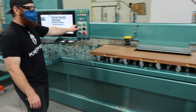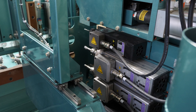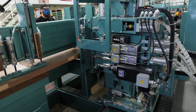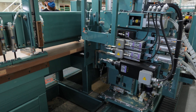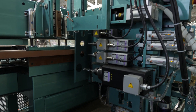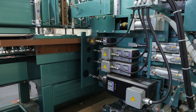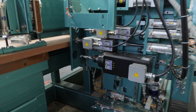We can hit the start sequence button on the button box. It'll move to the far end of the door, measure the length and the thickness, and then if those are within the bounds and parameters it will continue machining the hinge side of the door. This first hinge will be cut at 100% speed to show what the machine is capable of. The second hinge will be cut at 25% speed to show what each tool is doing.